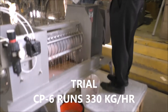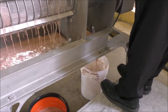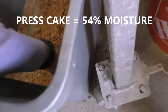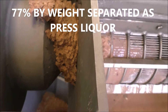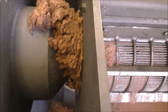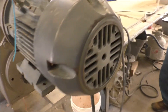We're running a timed test right now, collecting a press cake and press liquor. We're 44 seconds into the test and haven't seen any sign of blinding. If you grab some of this press cake, look at how it's coming out — you've seen what's going in. This is at 40 psi, a little less than 3 bar. Liquid coming out the full length of the screen. This is a model CP6, Compact Press 6 — has a bigger gearbox and the KP6 has a longer screen.